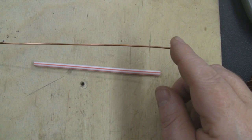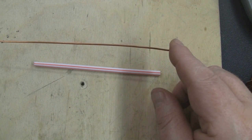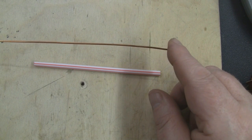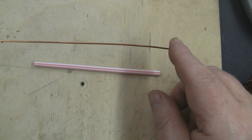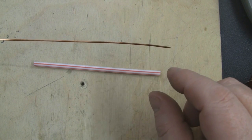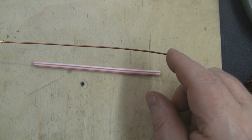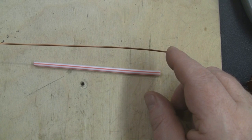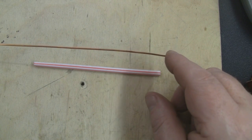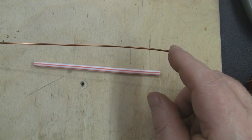The difference with using thicker wire for antennas is it increases the bandwidth, which isn't always desirable for FPV flying. I've seen videos where people make really thick wire helical antennas, and if there are a lot of people around using similar frequencies it can cause a lot of interference. So you don't want to go too thick — you want to stay at that center frequency.